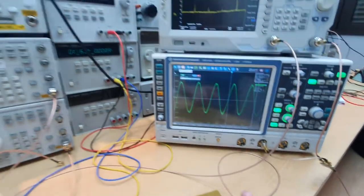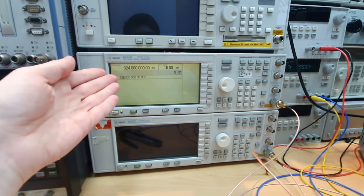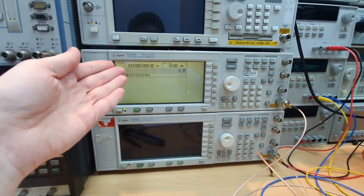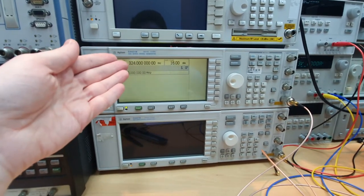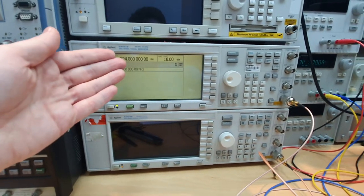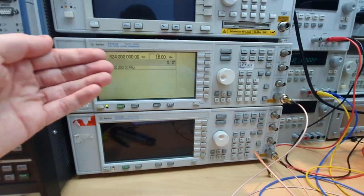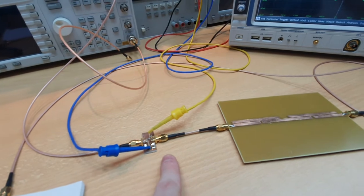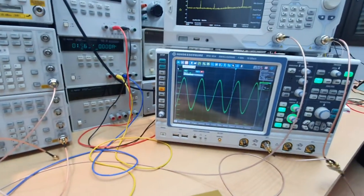Using this technique we can generate very high frequencies at the output using a lower frequency input. The advantage is that we can have a very low phase noise input signal that is much easier to synthesize with a generator or VCO. After generating this lower frequency input signal, we can multiply it to a very high order harmonic using the step recovery diode.